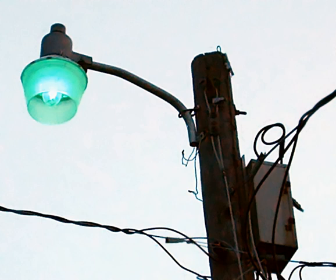These lamps have only the same or slightly higher efficiency than incandescent lamps of similar size, but have a longer life. They give light immediately on startup, but usually need a few minutes to re-strike if power has been interrupted. Because of the light emitted by the filament, they have slightly better color rendering properties than mercury vapor lamps.